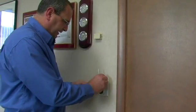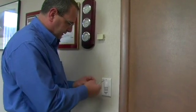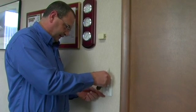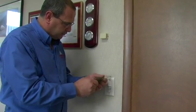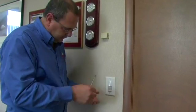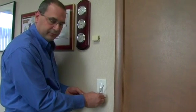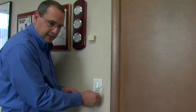Just to recap what we did: we basically shut the power down, removed our light switch, disconnected the three wires — your hot, neutral, and ground. We picked up an occupancy sensor from a local distributor, Lowe's, or Home Depot, and installed it just like we took the light switch out, just in reverse order. Now we'll go through the manual and set up the time frames as to how long we'd like it to stay on after a person leaves the room. And you're all done.